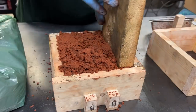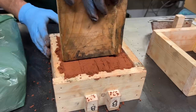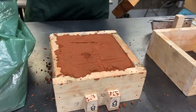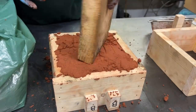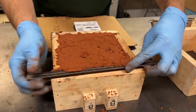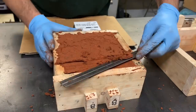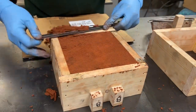Spray paint can be pretty tacky even when it's dried, and you're going to need to do something to keep that sand from sticking to the pattern. I ended up having to rub the pattern in graphite powder, and after I did that I didn't have any more problems with sand sticking to it. And last but not least, packing the sand — when you pack your sand, you want to pack it firm but not too tight. This shouldn't take all of your strength. If you pack it too tight, it will be difficult to get the patterns back out.